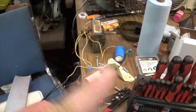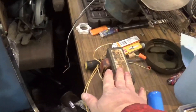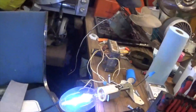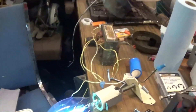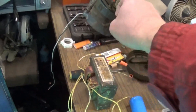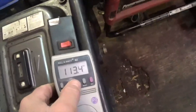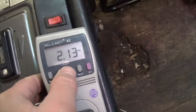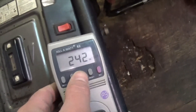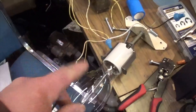Testing the old ballast on the table wired the same way as it was in the light. With no bulb: not terrible, not vibrating at all. With the bulb: very noisy, vibrating a lot, reverberating through the table. Reading 2.13 amps, 65 watts, 242 volt-amps, and 0.26 power factor. Now swapping the wiring around so the lamp common is separate from the plug common.